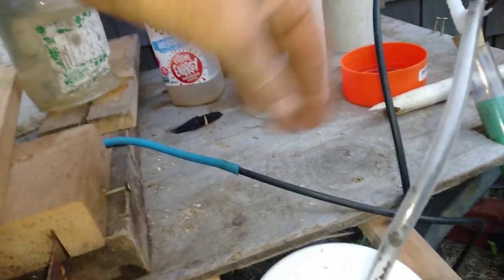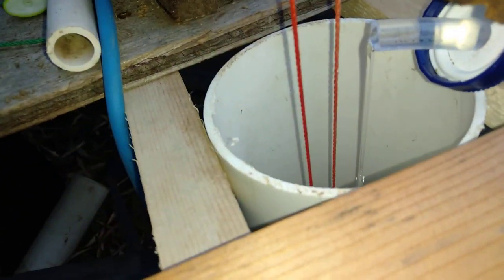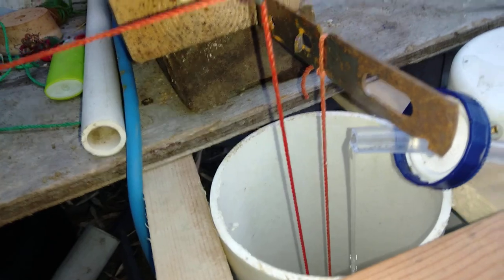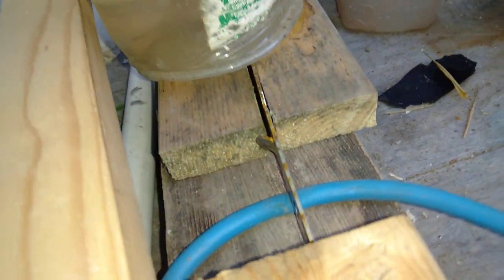So this is lifted up a bit — I lifted the float and air has been pushed out through this, and it pumps water out of this container and into the other. That will slow down and raise the float back up, and when it raises back up the float, this will go down and close off the valve.